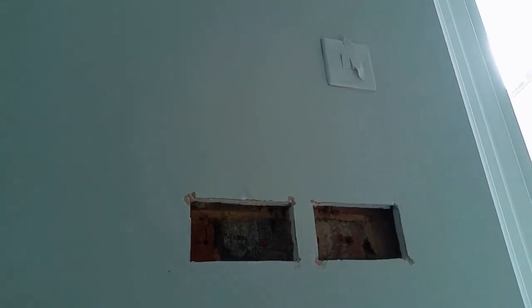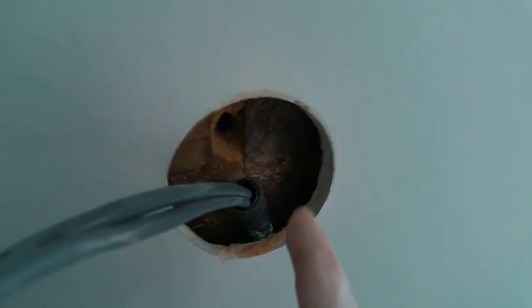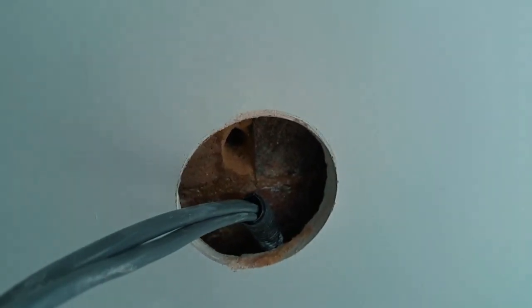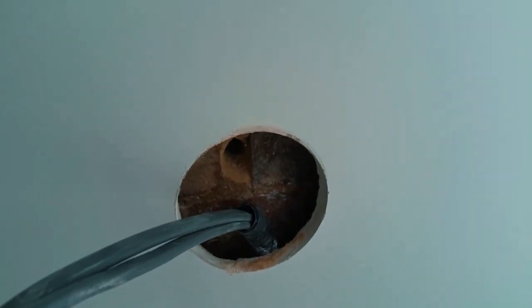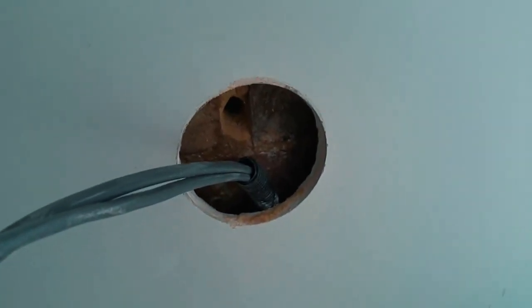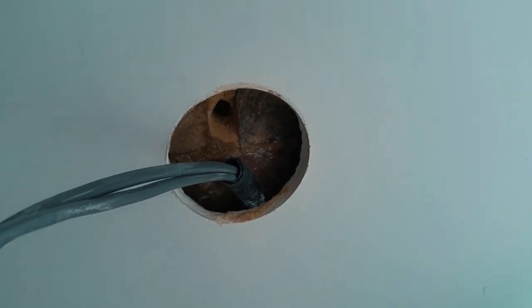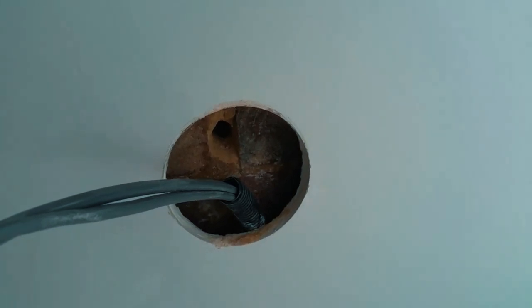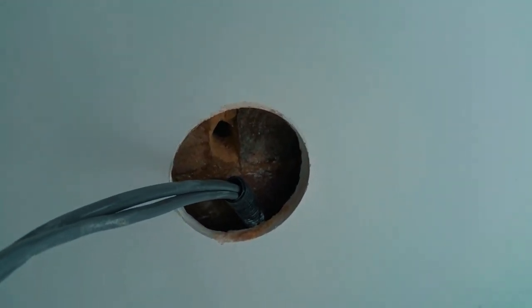Now, that is 27 centimetres off the corner of that wall, and if you come down, my entry hole here is 50 mil past that, which is so annoying. If it was loads, then for some strange reason it wouldn't be as bad, but because it's so close, it's quite annoying. Anyway, I was going to try and drill another hole at a slight angle, but what I might actually do is just chisel this bit out. If I can take the corner of that brick off, I should be alright, because to be honest, it's ever so slightly deeper than 50mm anyway.